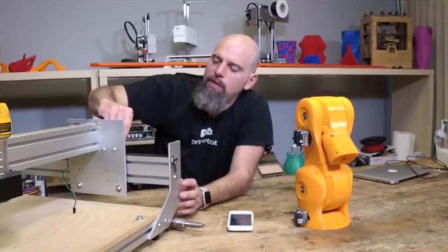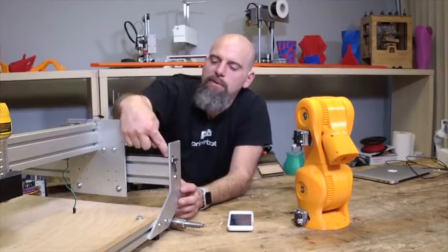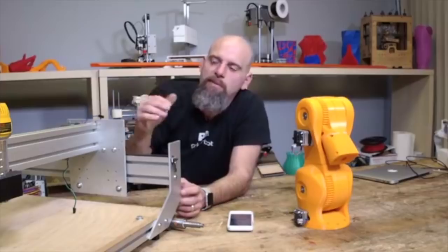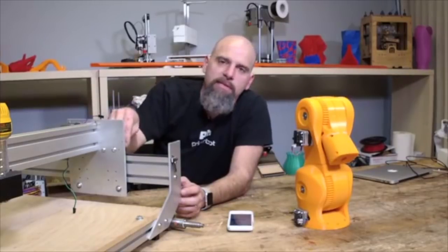Sometimes they can get a groove in them. If you put them on here and you cut into them when you roll them on and you don't have your eccentrics loose, you can damage the wheels and you hear this ding, ding, ding, ding, ding. It won't show up in your cut, but it bugs me. So, yeah, you might want to replace these over time.